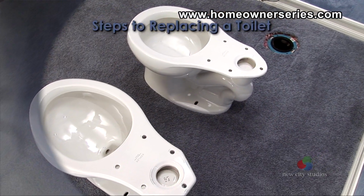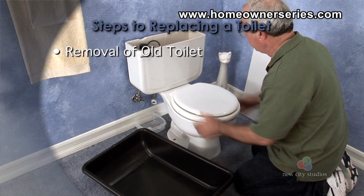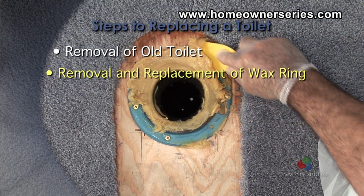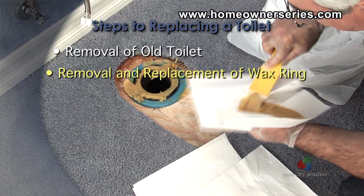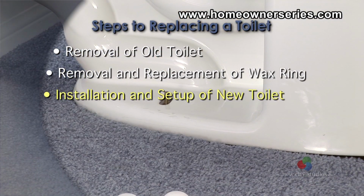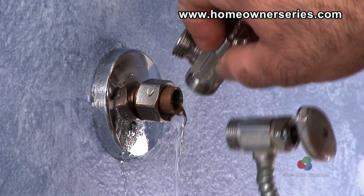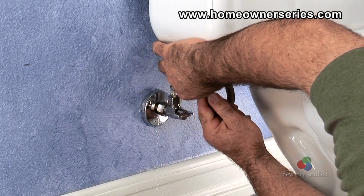Replacing a toilet can be divided into three main tasks. First, the removal of the old toilet. Second, the removal and replacement of the wax ring, sealing the toilet to the sewer line. With the third task being the installation and setup of the new toilet base and tank. Additionally, consider replacing the water supply valve and toilet tank hose during the installation of the new toilet.